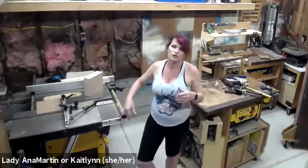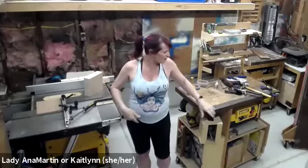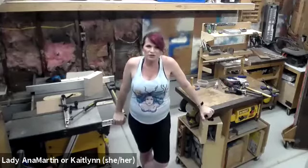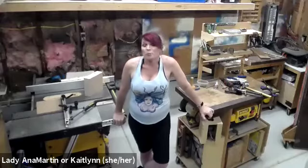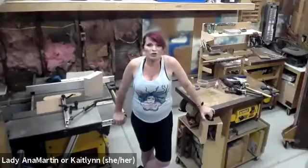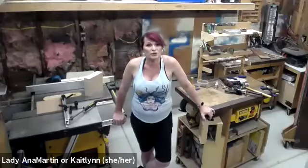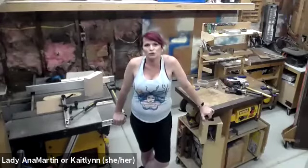And then a tusked tenon, you've seen these in SCA furniture before. The tusked tenon comes through the mortise, and then it has a pin that goes on the inside. Are Terra Pomaria's thrones held together with those? Yep. They're a period joint, and they look good, but they're a pain in the ass. They wear out over time, especially on something like a throne. I'll bet those tusks are really loose, right? No. Not yet? Paul just remade the thrones not too many years ago. It won't take but a few years before those tusks get looser and looser and looser.